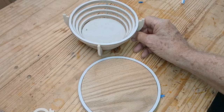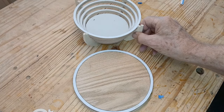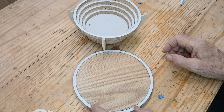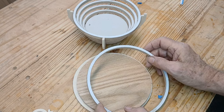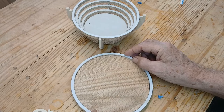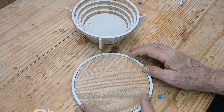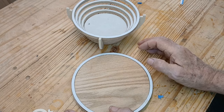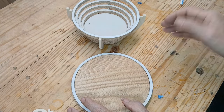It all cut out pretty nicely — wasn't hard to cut. I've kind of dry-fitted everything; nothing's glued together and it's fitting together very nicely. We'll have to pull these in a little bit as I go up with the gluing. I haven't got all the patterns removed yet because I'm just dry-fitting. What I'm doing here with the lid: this is the lid and this is the bottom piece that should fit down in there — I want to make sure it fits down in that ring without being tight. I also use the ring to make sure I get it centered on that piece. So I'm going to glue that on right now, then start removing patterns and work from the bottom up putting it together.